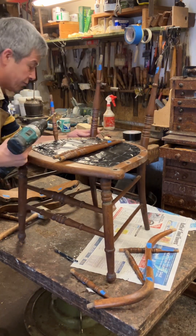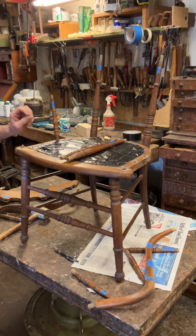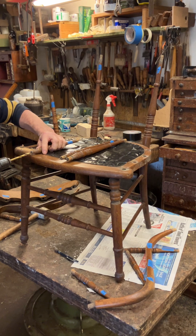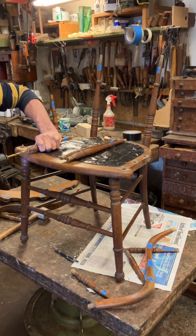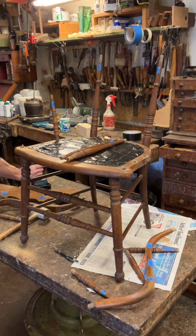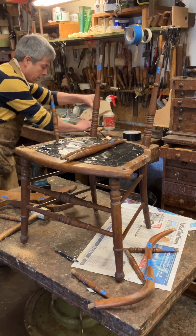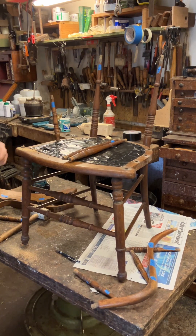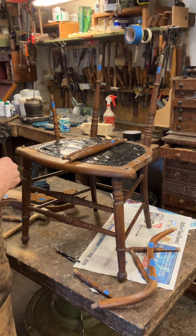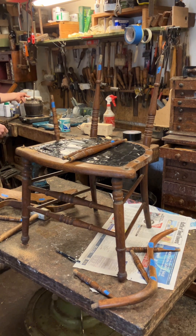I don't really want to go through the bottom of the chair, so I do that side quite carefully. But the spindle side it doesn't really matter how far you go - sometimes the further you go the better. Just make sure your drill isn't going to break the spindle out because it's too big. I've got a little bit of dowel here and that dowel is perfect - you see it fits really well. That was a very quick process.